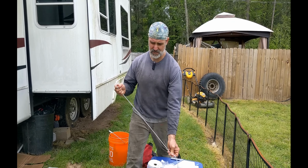The next thing is we want the head to countersink like this. So we need a drill bit that is slightly bigger than the head. This fits the bill. I'm gonna just carefully go down a little ways. That's how far down we are. So there's the number of threads that we have sticking down, and that should be just sufficient to screw into the frame. So 4 more of those and we're on to the next step.